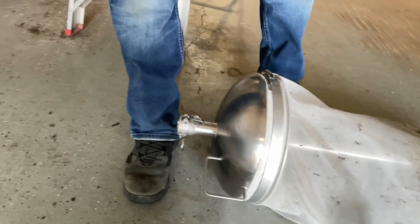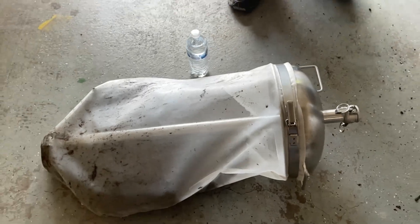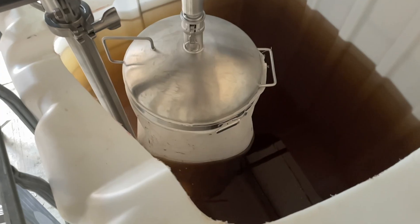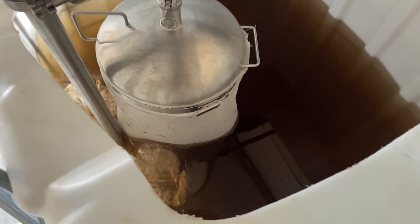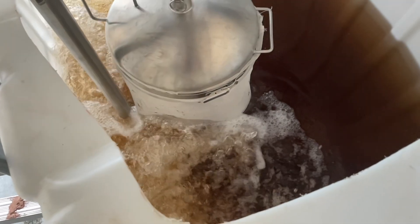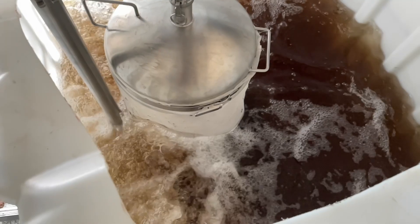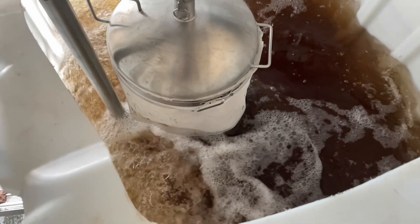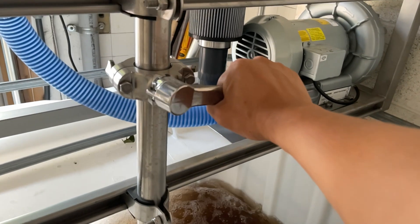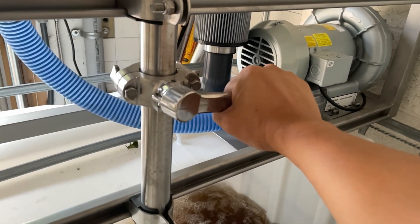Once the blower is moving, the T-bar sends large amounts of air to the bottom of the tank, which gives the water tons of oxygen, mixing it up in our brewer and constantly keeping our extract mix thoroughly. The valves for the bell housing and compost filter bag sit on a separate line that allows air on or off directly into the compost bag, giving a maximum amount of air and agitation to the brewer.